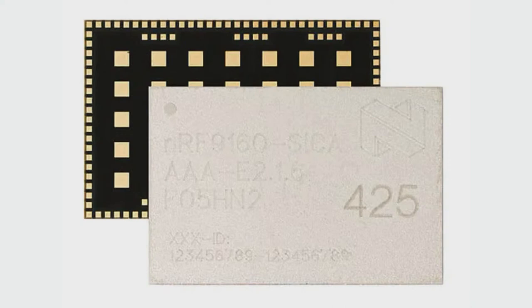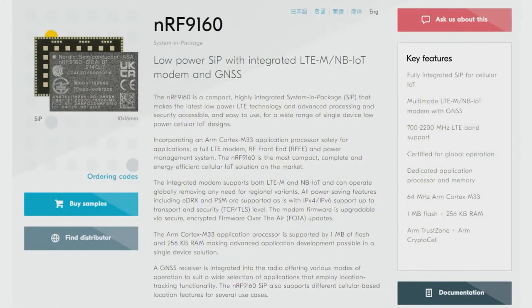I'll go to the next page — you can read it while I chitter chatter. They started with the NRF2401, the famous 2.4 GHz meshable network wireless chips that were so easy to use. Then they did the NRF8001 Bluetooth Low Energy, and then the NRF51, which had the integrated microcontroller. That's where things started to become really interesting, because instead of just being a peripheral wireless module, the microcontroller is embedded inside of it.